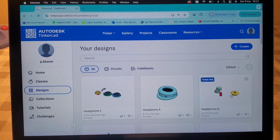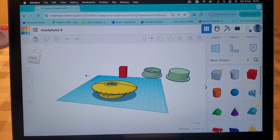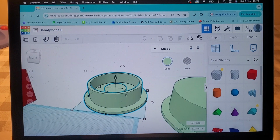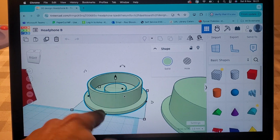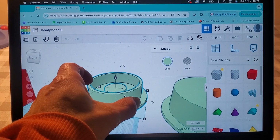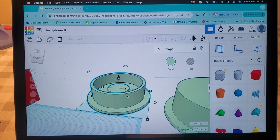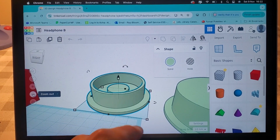So my first intention, build directly onto a Grado cup. So if you can see, if I zoom in on that cup, actually, see over there, this is a Grado driver cup, and the way they're designed is this is where the ear pad just connects that way, and then this is a plastic component which sits in the housing, where actually also there's a hole either side of this where the band will clip on. Now this first version I designed so that I wouldn't have to change this in any way. I could just slot it straight in.